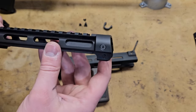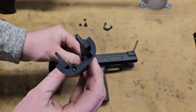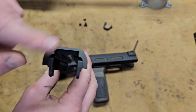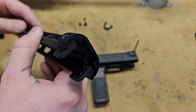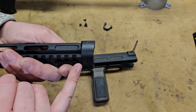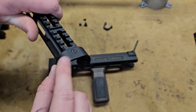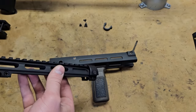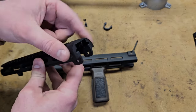Going back to the upper portion, there are two-millimeter screws up front. These are not necessary for removal or installation — they look to just be an element of the design. You can see how it's dovetailed into the Picatinny section up here, which is kind of clever — a dovetail for this collar bit that goes around the top. I'm not entirely certain of the purpose of that, because it looks somewhat superfluous as it just end-caps this section. The ears that actually attach to the gas block are not part of this little circle bit up top. I wonder if there's an additional engineering reason or if it was just easier to achieve the rounded look from the original handguard that way. But these are removable, so you could in theory run this without that bit on there.